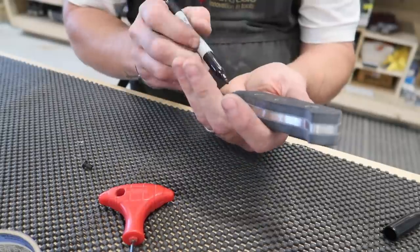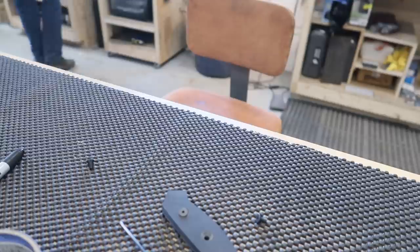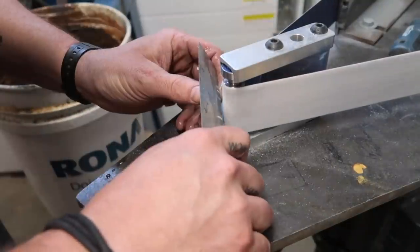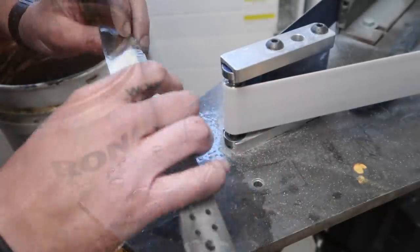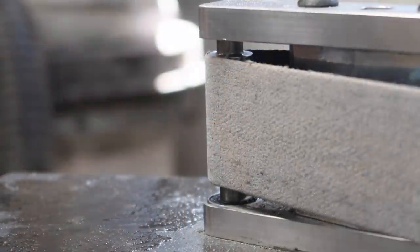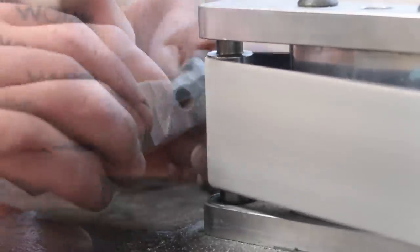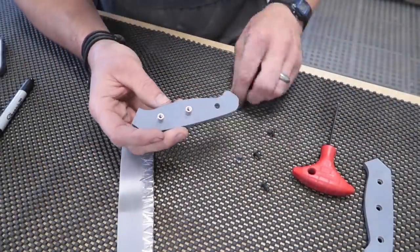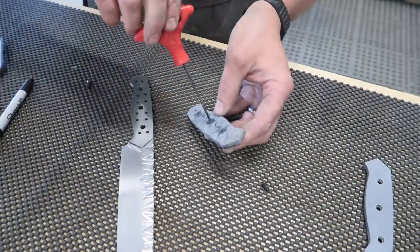What I'm going to do quickly is mark out where the handle is going to go, because I do not want any rock patterning underneath the scale — food would get in there and it'd be unsightly. I just want to make sure I know where that territory is so we can avoid it. This was actually very nerve-wracking because I put a lot of work into this knife at this point — nice bevels, everything hardened and heat treated. One little slip — if you sneezed doing this, that'd be heartbreaking. Luckily it all worked out. Then we can jump onto the scales. I'm doing the initial rock patterning of the scales off the knife, and once those are finished I'll bolt everything together and continue those lines around the tang of the knife. I basically get the rough rock patterning set up, and then once that's done I can continue with it when it's all assembled.